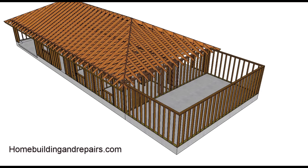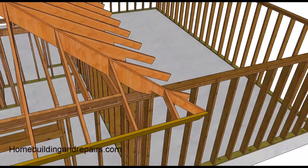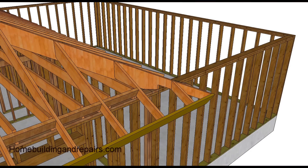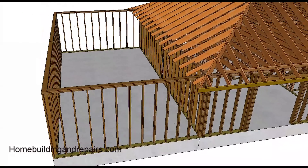Let's frame some walls and zoom in on the rafters. The blocks were removed — this all depends on your situation. You might need to remove the eave blocks; these might be painted and visible from underneath, or if you have a soffit you might not need to remove some of this. If you're going to frame it the way shown in this example, you may have to remove these blocks and then re-block it.